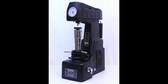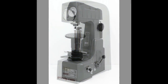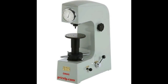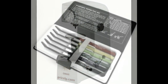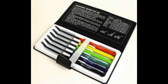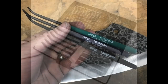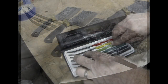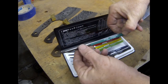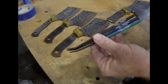The standard of the industry is a Rockwell tester. Unfortunately, these are a little bit overpriced for most hobby knife makers — over $1,000 for one of these machines. And if you don't know somebody that has a machine shop where you can use them, what we're looking at today is a set of testing files. These are readily available on the internet and they range in price from about $65 to $120.